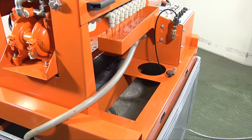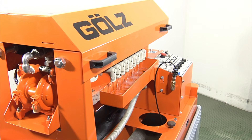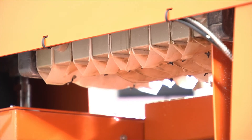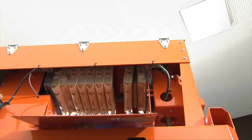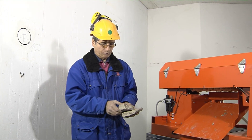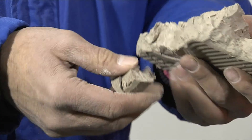In a normal operation cycle, the filtration chambers are filled within 10 to 15 minutes. The air powered slurry pump will stop automatically. Then the air actuated hydraulic press can be opened to empty the filter plates. The filter cakes resemble tiles and fall back into a storage container via a trash chute. The cakes are non-hazardous and can be disposed of easily as construction waste or recycled.